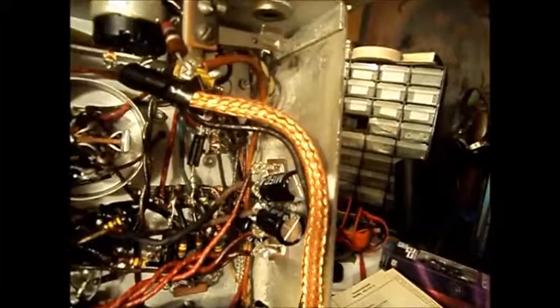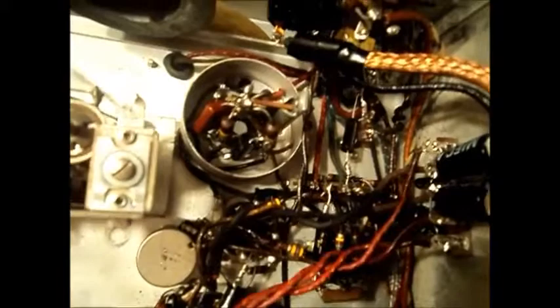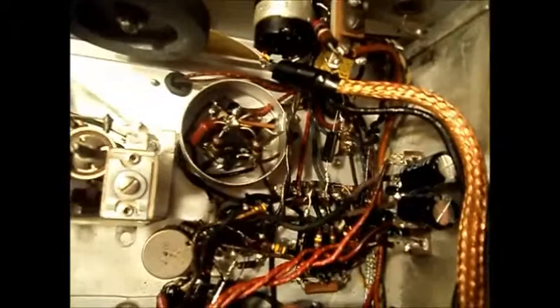I have the electrolytics on the side, which is kind of keeping with the radio design anyway, because this radio already has a fair amount of terminal strips from the original design. They used them as tie points. The cabling goes all the way around, very neat, and ties into these strips around the edges. So I thought that kind of fits in with it. And these black film caps from Just Radios blended very nicely instead of the yellow ones, which did stand out so much.